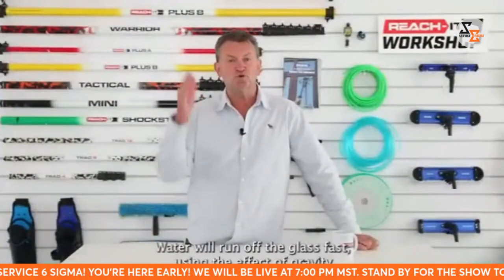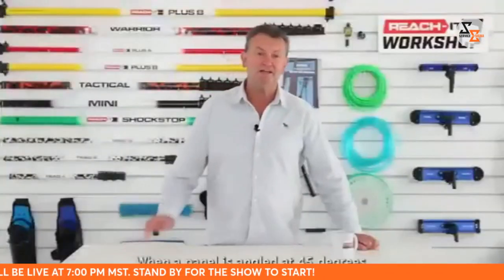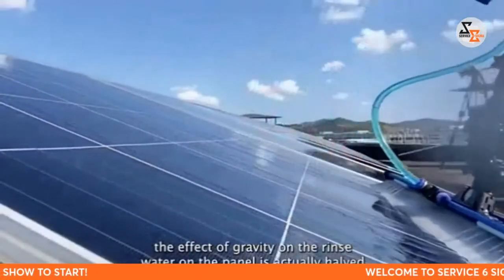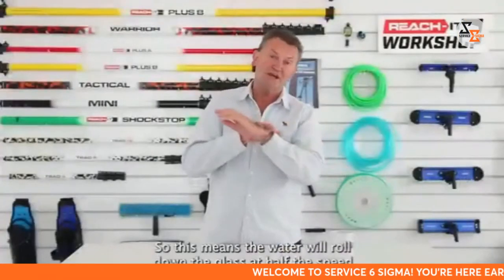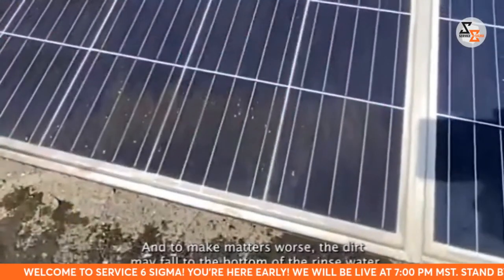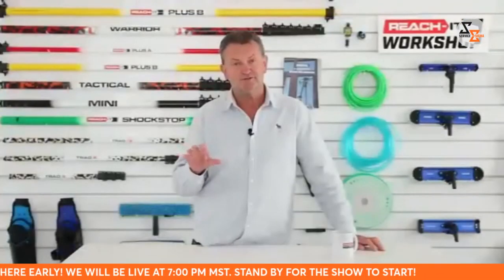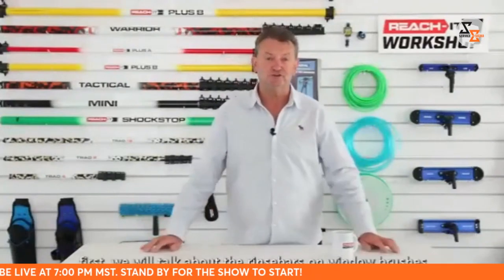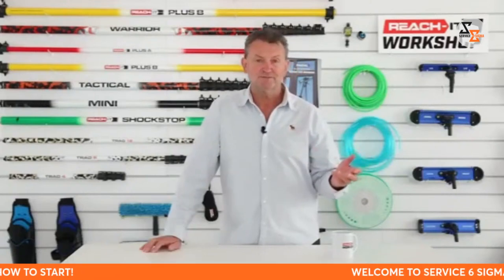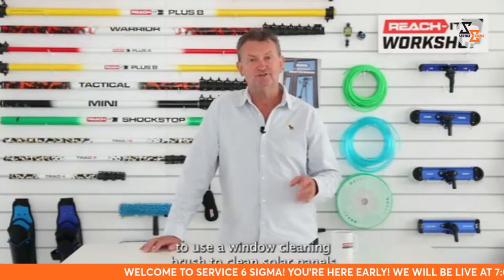At 90 degrees, water will run off the glass fast using the effect of gravity. When a panel is angled at 45 degrees, the effect of gravity on the rinse water on the panel is actually halved. So this means the water will roll down the glass at half the speed. And to make matters worse, the dirt may fall to the bottom of the rinse water and potentially stay on the panel, leaving dirt spots. So let's break this down. First, we'll talk about the rinse bars on window brushes and then how we clean solar panels. And then you'll learn why it is not as efficient to use a window cleaning brush to clean solar panels.